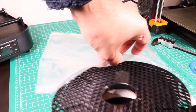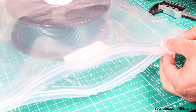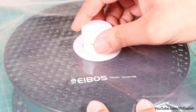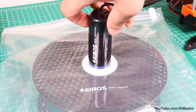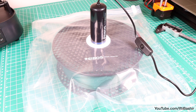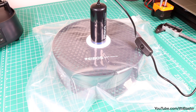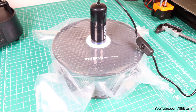The procedure itself is a simple one — place the filament spool inside the resealable bag, add a desiccant pack, then use a supplied clip to create an airtight seal. After that, release the cap to the built-in suction valve, screw on the vacuum pump to the top — easy thanks to that threaded collar — and with the USB connected to power, press the power button to begin sucking the air out of the bag. The vacuum does make some noise, but does a perfectly good job of drawing out all of the air, ensuring the filament stays completely sealed in an airtight wrap.